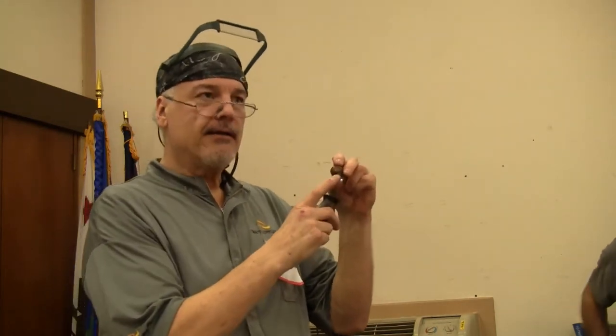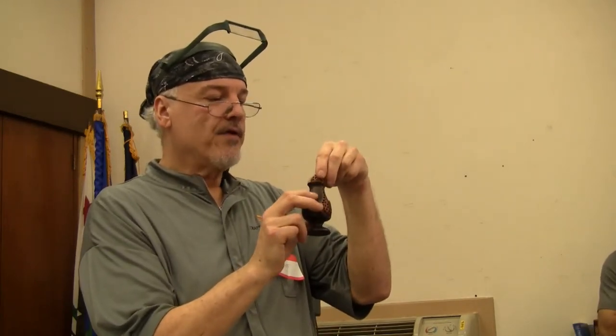So I opened it up a little bit more so that it actually makes you want to look inside the vessel. And what I did with the top of this, we pierced the top, but I also put a little ebony finial in there with a mother of pearl. So that when this is down, you're looking into a dark void, but what's going to catch your eye is the pearl. And it's just bringing another dimension to the visual aspect of your turning.